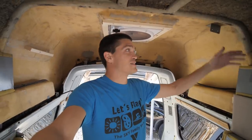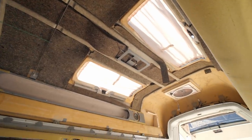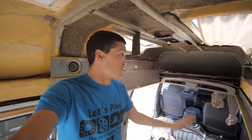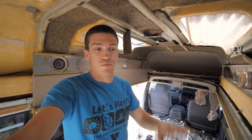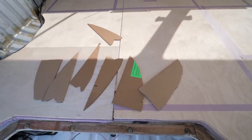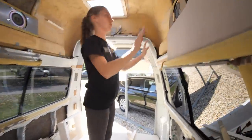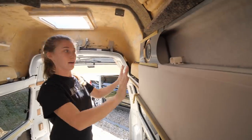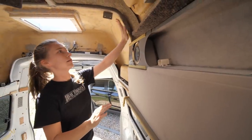This ceiling has a lot of weird contours and weird shapes. We do have a pretty good plan — we have to run to Lowe's though. We're going to buy all the paneling for the ceiling, and our plan is to do all blocking. Brian kind of helped us out, and then Shannon came up with a good idea to cut it with templates she made from cardboard. I've been envisioning how we're going to run the ceiling and I've narrowed it down to five planes. Plane one is this plane here, which can only go up this high because of this support.